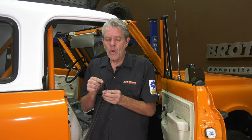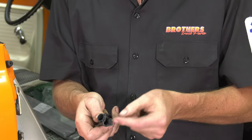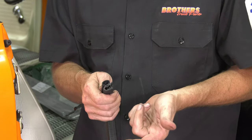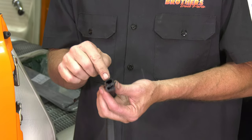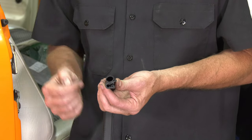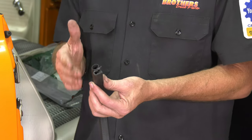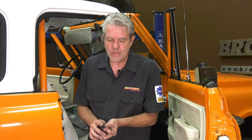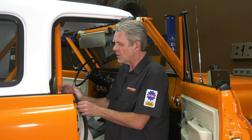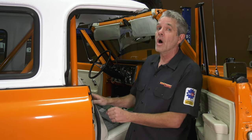Here is why I love this rubber over the other one. Right in here, the part that actually clamps onto the edge has a metal sleeve in there — you see how it's open there — I can just crush that and it'll stay like that. Another thing to check when you're looking for quality rubber is that this round piece right here is hollow. On some of the cheaper ones they'll be solid or have really thick rubber, and then you can't shut your door well. This has to be nice and pliable so you can shut your door easy. This simply fits on like this — you don't have to do any glue or anything — but we're going to start at the other end first.